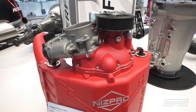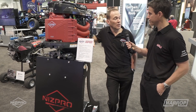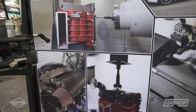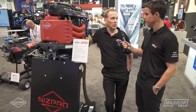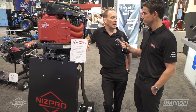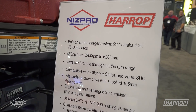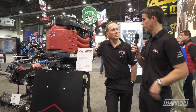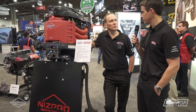One of the most common questions is how much power does it make and does the engine achieve what you quote? On the dyno test cell, the calibration has all been done on 89 octane fuel. On 89 octane it makes 467 horsepower at the flywheel and 450 horsepower at the propeller shaft. Our preferred gasoline is 91, but it certainly tolerates 89 without any drama — that's what the main calibration has been done on. The calibration development has been extensive, with the ECU having the capability to compensate for those different fuel grades.